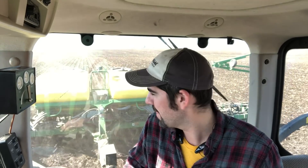Planting corn and doing a good job raising corn is all about consistency. You want every seed to be spaced exactly the same distance away from the seed next to it. You want every seed to germinate and you want every seedling to come out of the ground at the exact same moment. So what we're trying to do is minimize any deviation possible with our equipment as we're going along and planting the corn. We want to do everything as identically as we can to the seed before it. The idea behind the seed firmer is just to make sure that every seed is pressed firmly down into the bottom of the furrow so that you have consistent seed-to-soil contact and consistent depth of each seed.